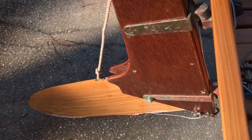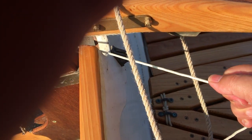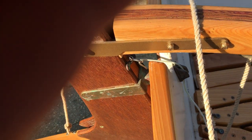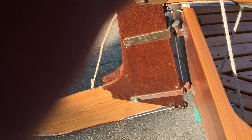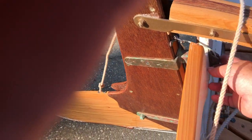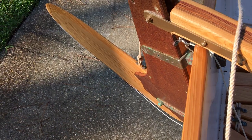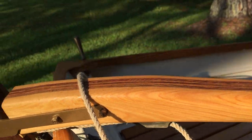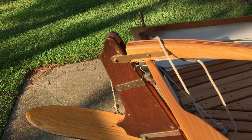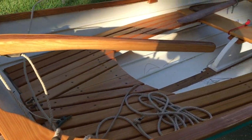Right now skipper wants to leave that area clear so when she's leaning over uncleating the uphaul and getting the rudder down — the rudder floats because we didn't put any weight in the bottom of it — she needs to reach over and pull on this little rudder downhaul line and then jam-cleat it down. The jam cleat holds it in place but lets loose if we hit something, so we're happy with that. When we come back in, we just uncleat the downhaul, the pressure comes off the rudder, it floats up, and we can cleat it off for when we bring it back up on the beach.